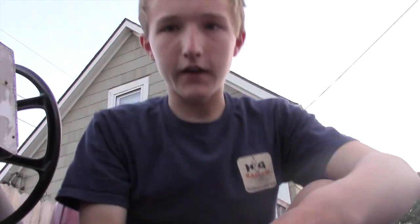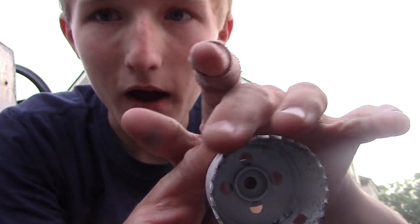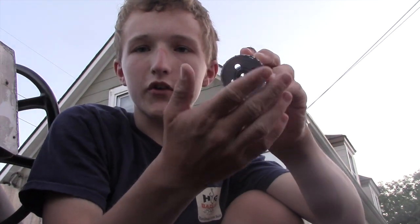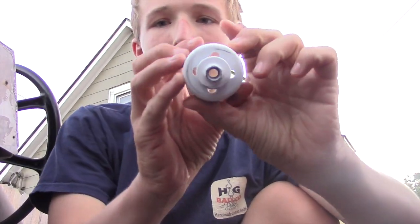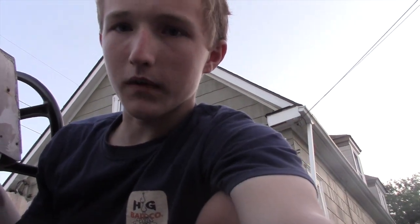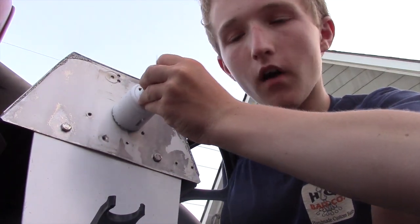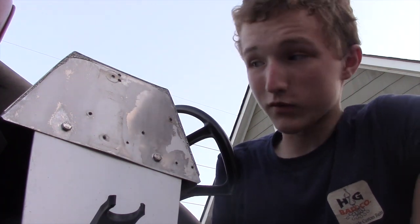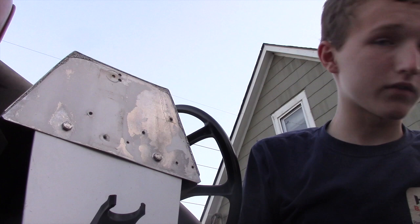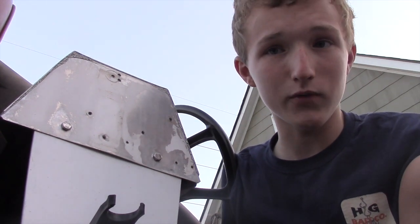When you're drilling, you can see how the teeth are on this bit — the teeth are facing to the right. You want to drill backwards so the teeth drag on it, because if you go in the forward direction the teeth will grab the aluminum and just shred it. So you want to go backwards. It takes a little longer, but if you have the guide drill bit in there it'll be just fine. As soon as you catch the aluminum the hole can be too big, and you'll have to pack more silicone in there — and that's another big chance for your boat to leak.